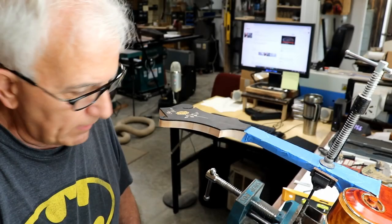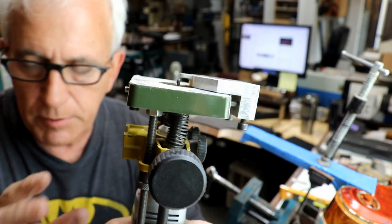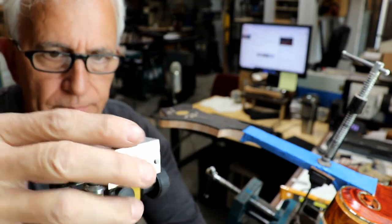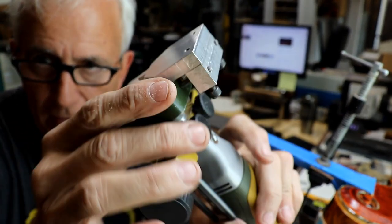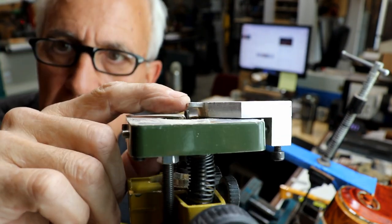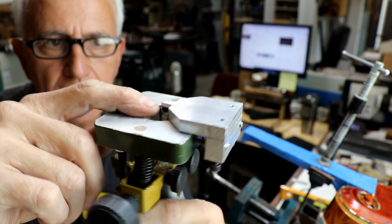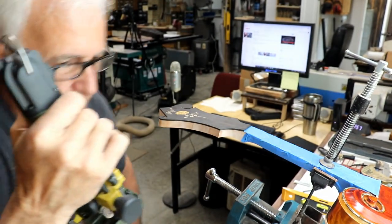Very handy little outfit. I'm going to give it a shot. I have my little rig here — this is the Proxxon router. The only reason I'm using it as opposed to the Dremel is simply because I had already made this attachment for the Proxxon before I got the fancy base for the Dremel. My brother actually doesn't give me any compliments ever, but he called this genius. It's a way to adjust the depth of cut — this little tiny lip rides along the edge of the wood, like a bearing on a router, and that only lets you go in so deep. I've got a spiral bit cutter here. It's a little risky, but we're going to give it a shot.